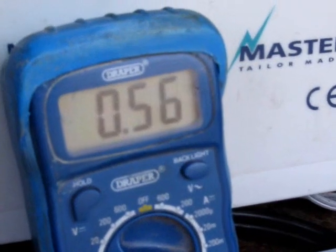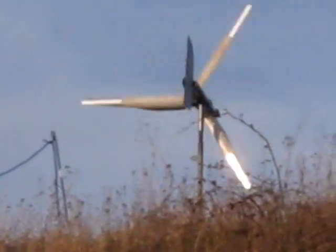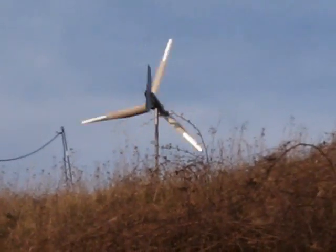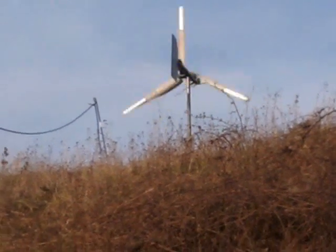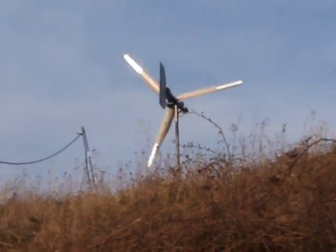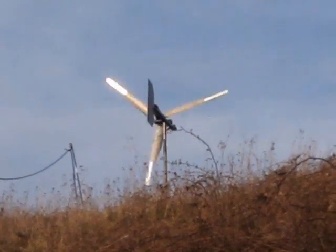There's very, very little wind — quickly panned round to the turbine and as you can see it's just ticking over. Normally to put out any power at all, that would have to be running about six times faster. I'll persevere with this for a while and see what it does under higher wind, then maybe post another video showing the output. At around 200-plus RPM I'd be hoping to get maybe 2.5 to 3 amps running flat out when it furls — definitely getting 3 amps at 28 volts. A couple of those is enough to keep this battery bank trickle charged.